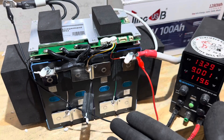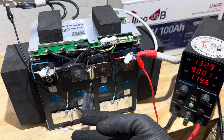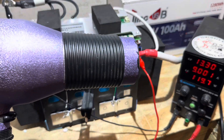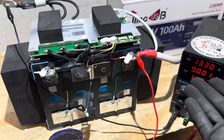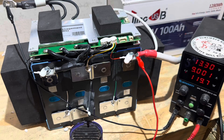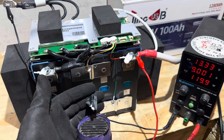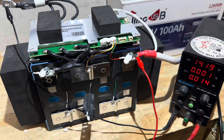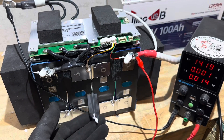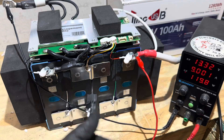I'm going to check the high and low temp cutout on this battery. I've got my little power supply hooked up to the battery charging, and here's the NTC sensor on the cell pack. I'm going to hit it with high temp first — shoot the hair dryer on this sensor and see how long it takes to cut off. If it works, you'll see this drop to zero. It triggered — exactly 30 seconds according to the camera viewfinder. I cooled it off, and it got back to charging. Nice.